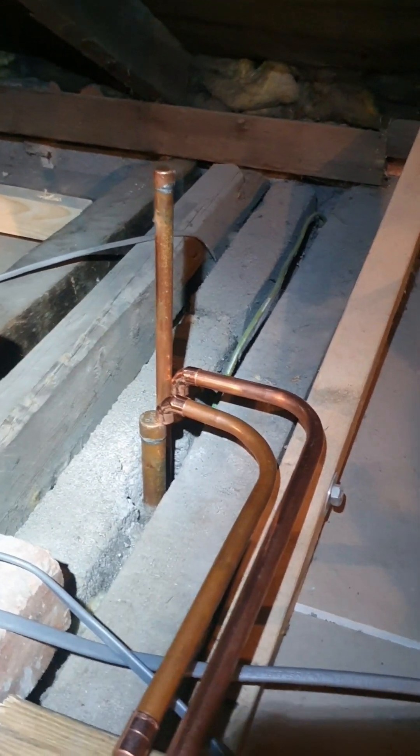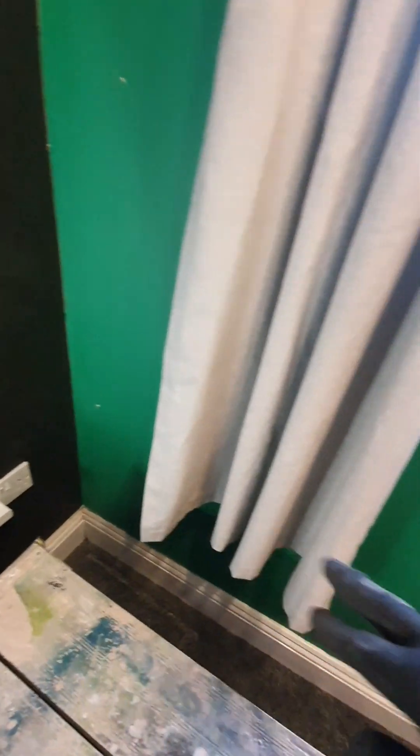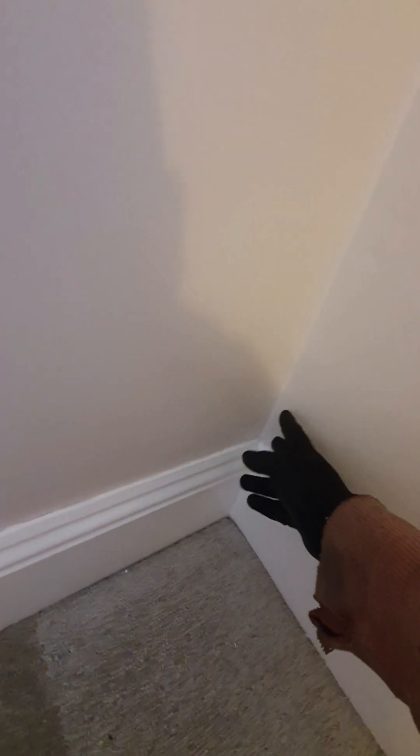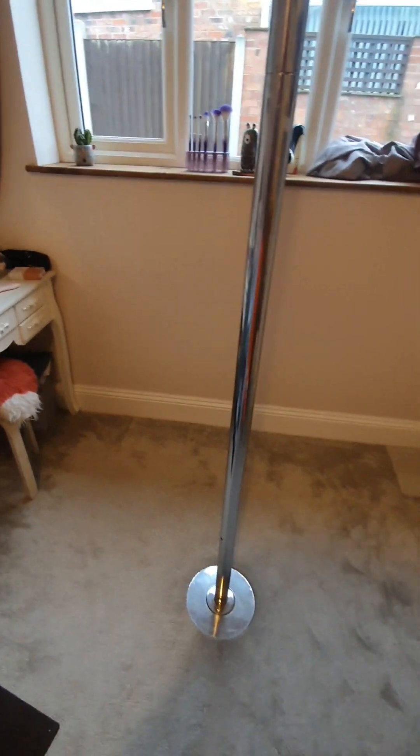The kitchen hot tap is further that way and there's also another bathroom hot tap. So we're downstairs now — the plan is to come down into this corner with the two 15mm pipes, come across here for this radiator, and also drill through to pick up another radiator on the other side. This is the other side of the wall in the other bedroom — get two holes in here, come across and then up on each side for a radiator underneath that window.